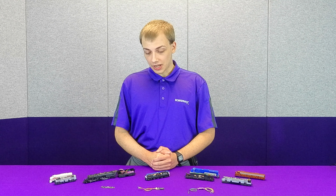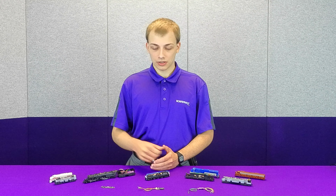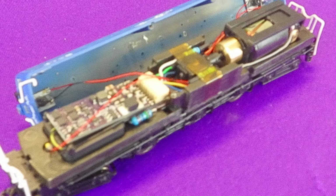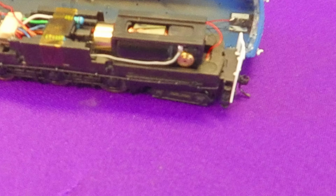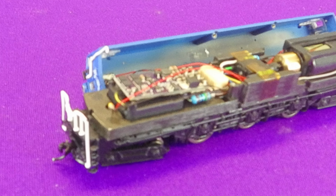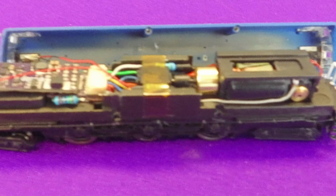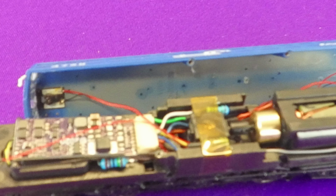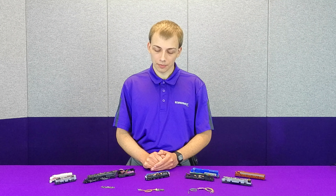And I want to take this opportunity to highlight something about the TSU N18 when used with the JST N18 adapter. Overall, its total height is about the same as the TSU 1100. But that height is only for half of the length. As you can see here, we have a section which is at a much lower height. So if you have a model like this one where you can take advantage of that, in this case I have arranged the model such that the decoder itself is running over the speaker, and then the JST N18 adapter exists in this area where we have a lot more height to work with. So we end up with a much lower overall profile for the decoder.